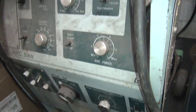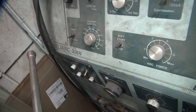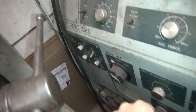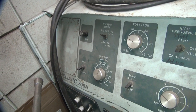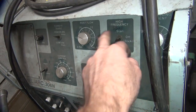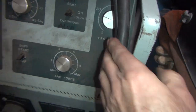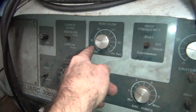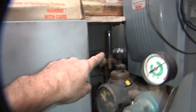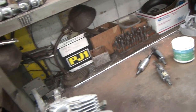We're on aluminum. Where's our amperage at? 225 — that should be a little bit higher, at least 230-ish. Run AC, which we want to be on — there we are, continuous aluminum. Here's another switch to run. We left all the other settings like this because that's what worked before. The post flow has gotten real low. Over here on the back of the flow meter it's about 15 or 18 pounds or liters — not a ton.